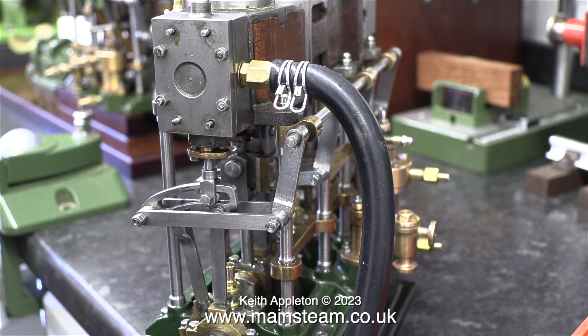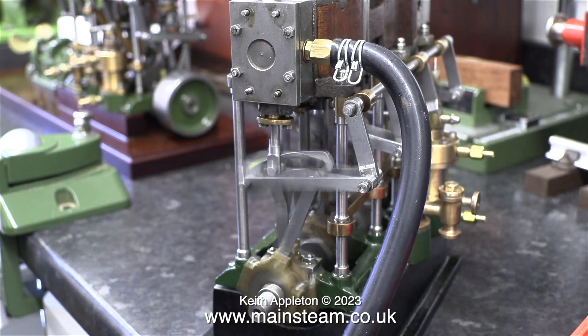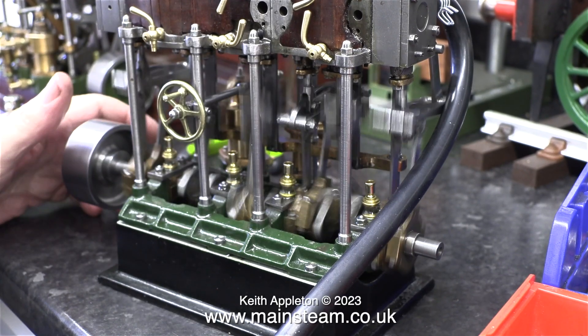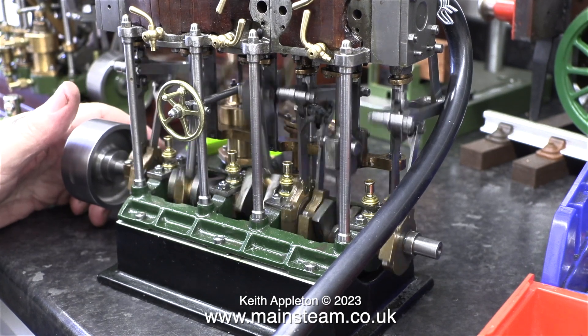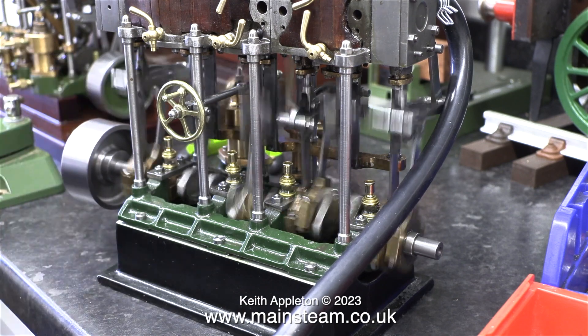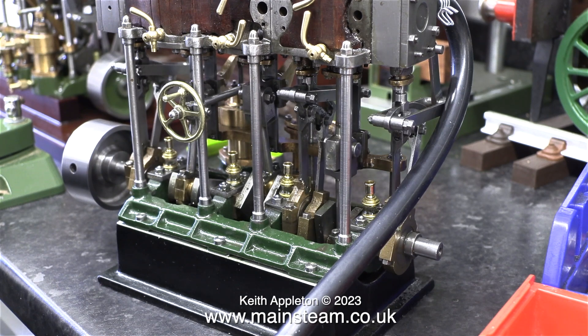I've wound the handle to the other end again — little did I know how much fun this was going to be. It is definitely looking like I will be making some new eccentrics, all individually adjustable. When I slow the engine down you can hear that the beats are uneven, so this setting isn't right — but it has to be this way to make the other eccentric approximately correct as well. When I was putting this engine back together I very carefully adjusted the position of the intermediate cylinder's valve so that it was the same in forward and reverse.